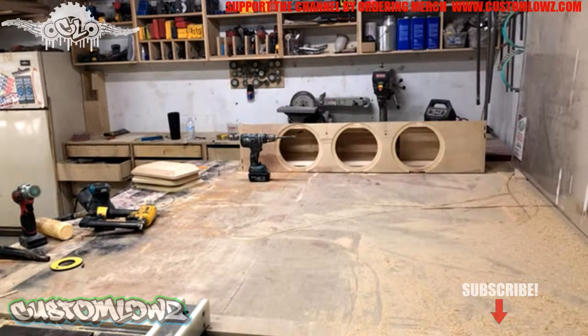I would say typically my 4/8 enclosures have about 25 to 32 square inches of port area. And that's usually just how it turns out for what will actually fit inside the box after all the displacement. You don't want to start making the enclosure volume too small over trying to fit more port area, in my opinion.